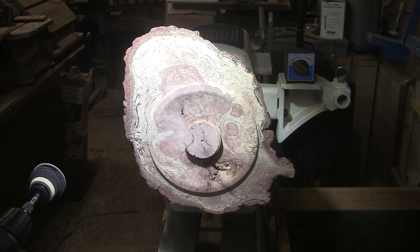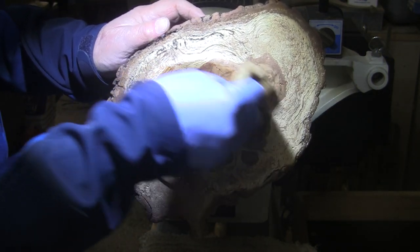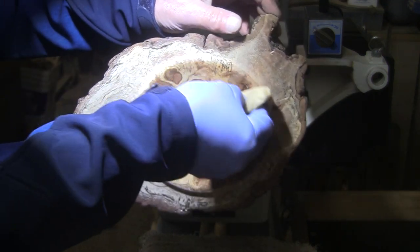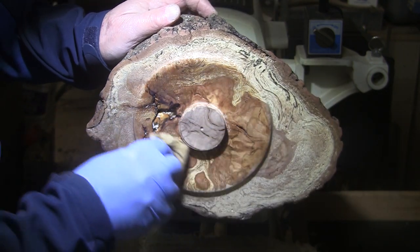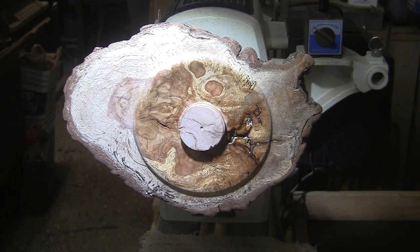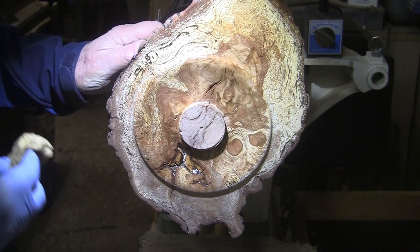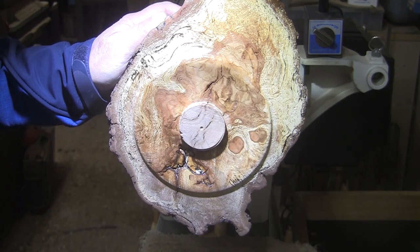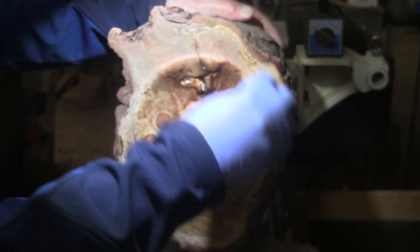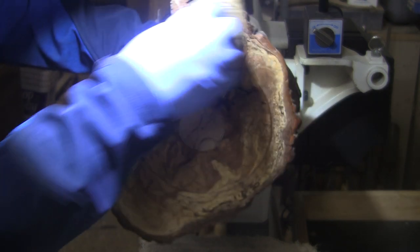And that looks like that'll be pretty easy. I'll bring it back here in a bit and we'll put some sanding sealer on there. I'm curious how this is going to finish up. This heartwood is real hard, real smooth. And the sapwood — the lighter color — I don't want to say punky. It doesn't act punky, it looks punky. We've got to find out. This is a shellac-based sanding sealer called Zinsser Seal Coat. Well, it appears to be finishing up okay. It does have a slight texture to it like punky wood does, but not nearly as bad. Maybe it's like that because it's a burl. But it sure is pretty.